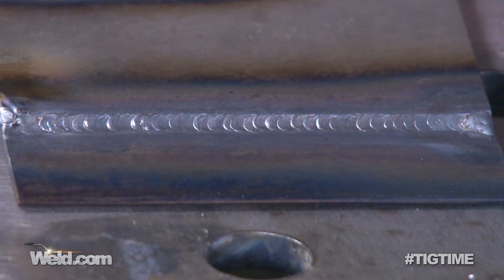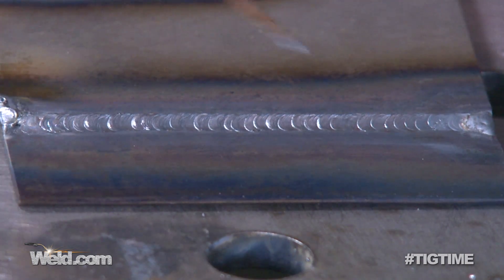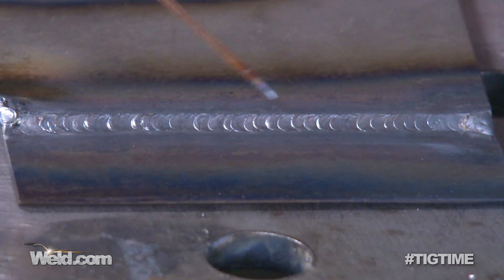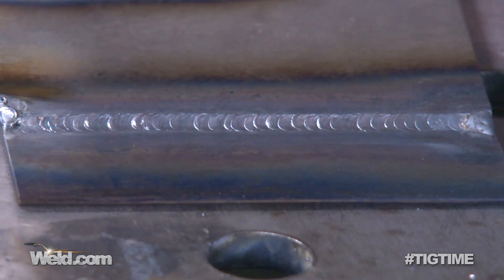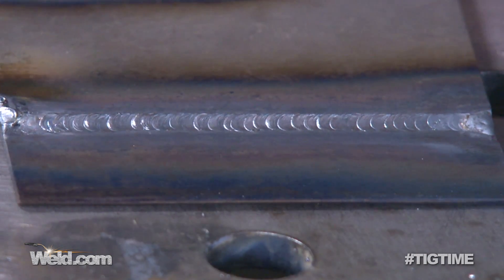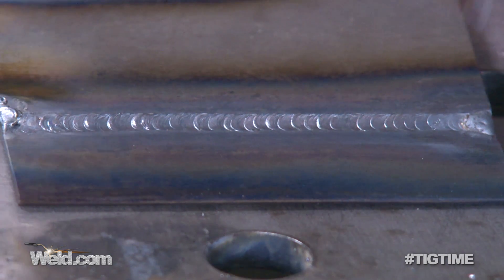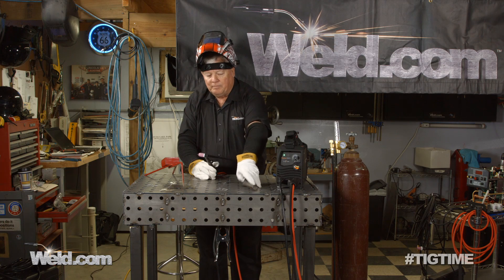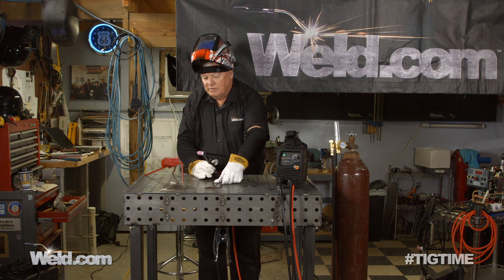It does look a lot better now. I'm just dabbing — my filler material is ER70S2. It's welding very nice. I've got this thin plate sitting on a heavy tooling table, and it's taking a little bit of the heat away. It isn't very fast, but you can sure make it pinpoint precise. I'm going to come to the end of my weld and terminate it. I just established an arc, you can see the liquid puddle, and then I just dab, dab, dab. This is very much like doing some body and fender work — you cut out a piece, tack it, and when you weld, you keep the heat really low to keep the distortion down. There's not a lot of positive reinforcement when you polish this off.